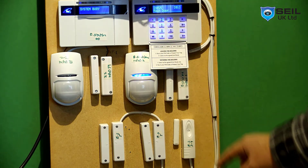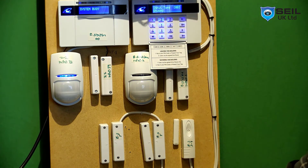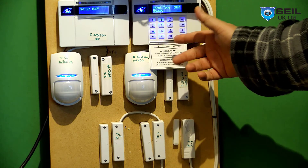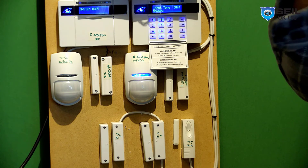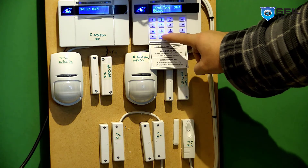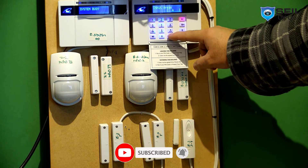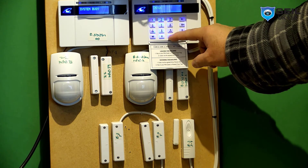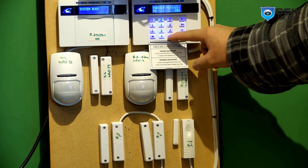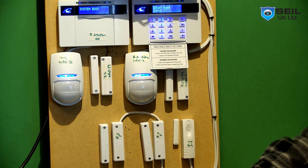Go to change inputs, press yes. Zone 17 is unused. For this sensor — for example if you put it at the garage — I give it zone type 06 (intruder), then press yes, area A and B yes. No chime given. You can change the name here — like 'garage room' or whatever — I'll leave it as is.